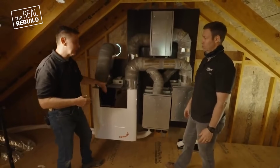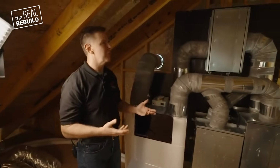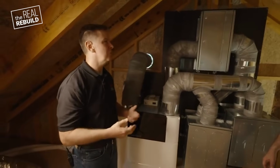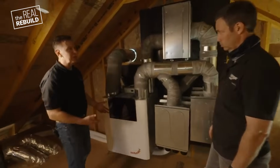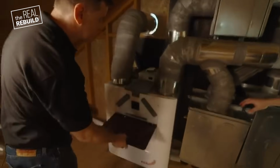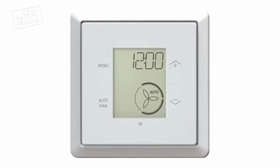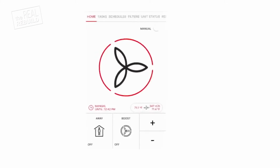And then on the humidity side, we're going to recover about 2/3 of the difference between outdoor and indoor humidity. The Q600 is a really smart ERV. So the controls are basically, this is a self-balancing unit. The controls are constantly monitoring the air temperature.